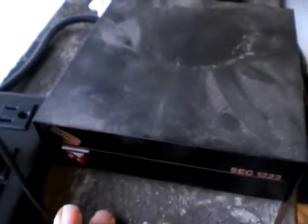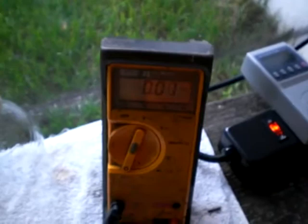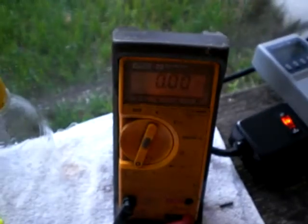So basically I brought out the big gun — this is my 20-amp power supply, and it's actually for my ham radio gear. If any of you shop at Amateur Electronics, you'll recognize what that power supply is. It's not all that expensive. I believe it's rated at 20 amps but will go to more than that. However, I'm having to use the shunt inside the amp meter, so the most I can allow it to go before I blow the fuse is 10 amps.